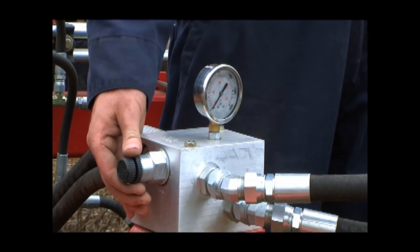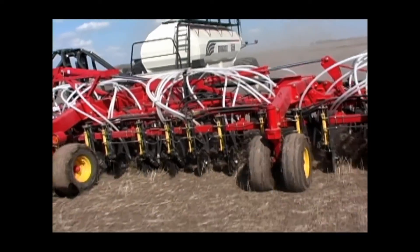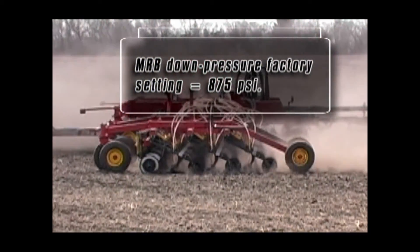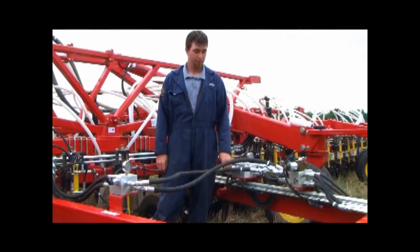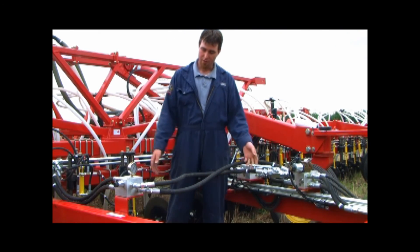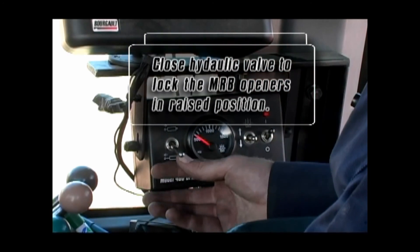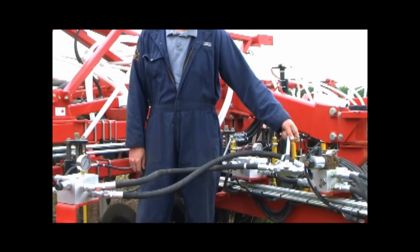Generally speaking, you should only have to set the MRB down pressure at the beginning of the seeding operation, unless you encounter an area where you can't penetrate, such as a very stony patch in your field. The factory setting for the MRB control block is about 875 PSI, which is sufficient for a wide range of seeding conditions. The mid-row bander lockout valve allows you to lock the mid-row banders up when they are not in service, raising the unit so the banders are out of the ground. Close the bander lockout valve and the banders will no longer move up and down with your PHD control circuit. To reactivate the mid-row banders, simply open the ball valve.